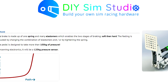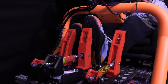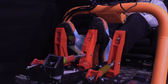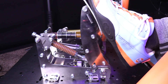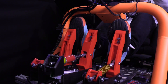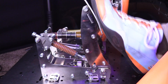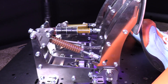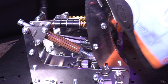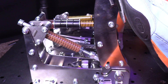The brake pedal has adjustable pressure by changing the springs and elastomers to different combinations. And yes, despite a hundred kilogram load cell, the 3D printed variation is built in the exact same design. You can also adjust the stopping point of the pedal and the pedal face. The clutch operates identically to the throttle with exception of the back hinge point stopper. In the case of the 3D printed clutch, it is identical to the gas with exception to what spring you put in it and it has the exact same adjustments. The metal versions are upgraded with an elevated and swinging stopper that has a digressive mechanism to create more of a clutch feel.